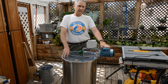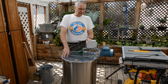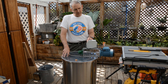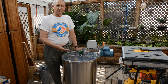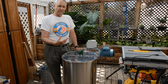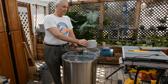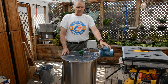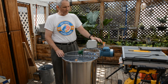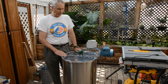I believe I spent $45 for this motor. Same thing with the variable frequency drive or VFD — this is a surplus unit from Automation Direct. Single phase input, 120 volt; you can also get them in single phase 208 volt, 480 volt, or three phase input, whatever you want. They're rated by horsepower; this drive here is a one horsepower drive, though this is only a quarter horsepower motor. When the motor is running it only draws about 0.8 amps, so it's barely loping along.